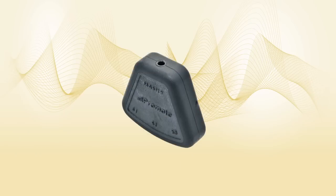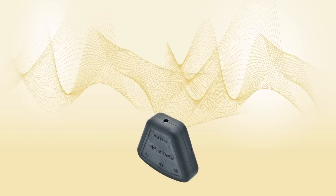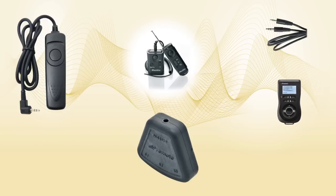The master port on the hub is used to receive a master shutter release signal. It is a standard mini stereo plug that has the same size and wiring as the Canon EOS Rebel Camera Series. You can use your existing wired or wireless Canon EOS Rebel remote releases if desired. Alternatively, you can connect a separately available Promote Control Wireless Remote sensor to the hub's master port, or use one of the cables supplied with the hub to connect another master controller device, such as the Promote Control.